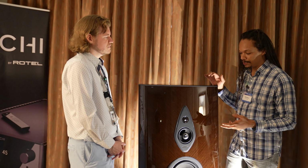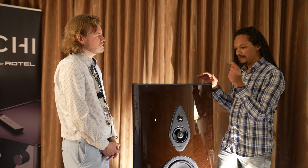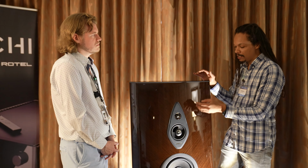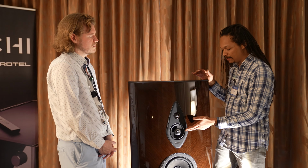With the Intono technology, essentially what we're doing is utilizing the individual sealed enclosures and the tuning of a port in between them, such that when the pressure builds up such that it would create an impedance spike in the mid-range frequencies, that port fails or opens up, right? It's no longer a port with vibrating air back and forth. It's essentially a hole that allows that pressure to dissipate into another enclosed chamber, right? So we're taking the failure of a port, the detriment of a ported system, and using it to our advantage, because we know there's going to be a certain frequency where that port opens up and just allows natural passage of that air back and forth.